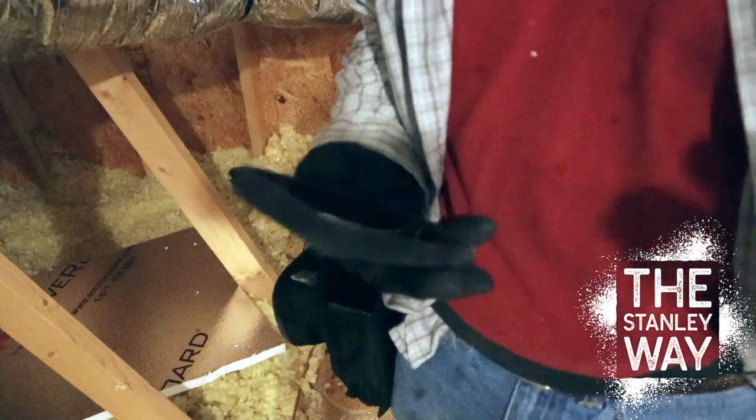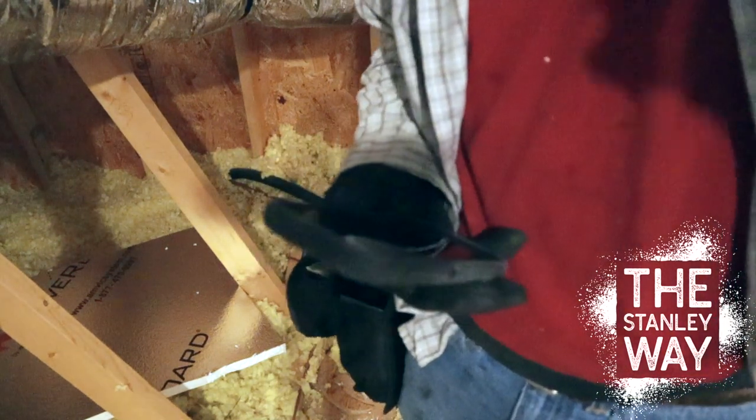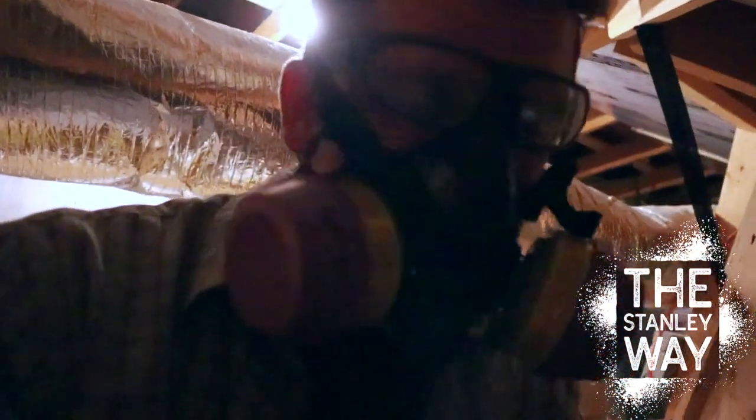You always want to make sure you have your phone to answer your wife. I got two missed texts while I was filming earlier, so I'm already in trouble. Also, get some three-quarter-inch plywood that will reach all the way across the ceiling joists so you don't have to worry about stepping through your ceiling. They make great work platforms, but you still got to be careful — you don't want to end up like Clark Griswold in the attic scene of Christmas Vacation.